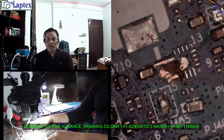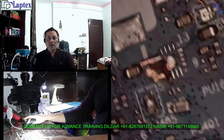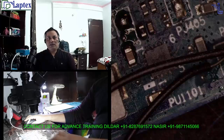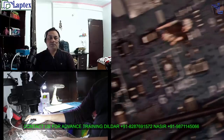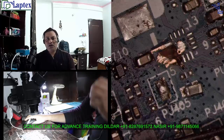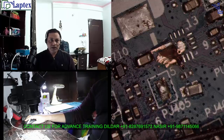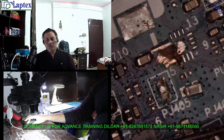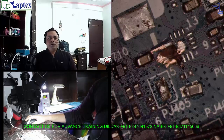This is the 3.3V and 5V regulator area. Here is the area where 3.3V is available and 5V is present — you can see the track is short. If I try to use a new IC it gets burned, because from here this is pin number one or two and this point sparks, so whenever I try to use a new IC it gets burned.